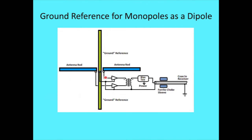So I put this metal rod in here, which was 1.2 meters, about the same size as that, and carefully centered it. The preamp ground is hooked to there, and then the ground going out of here has a decoupling choke on it. That combination considerably reduced the amount of 15 meter ham signals that were coming in even before the sun was up. I didn't have any actual measurements of it. The sun had to be up quite a bit before you got any, and then they were weaker. It was predominantly horizontally polarized, whereas it had a very strong vertical component until I carefully balanced that out. And that's the thing about one plus one-half plus one-half not equal to one. You have to add this piece in between here.